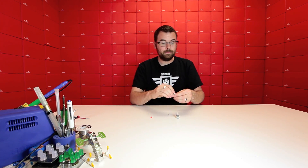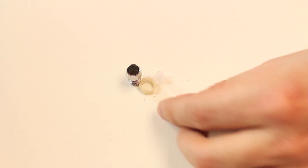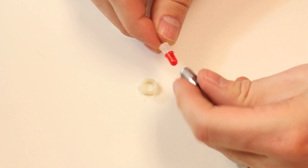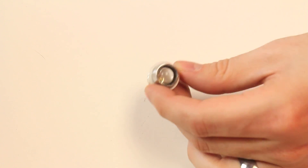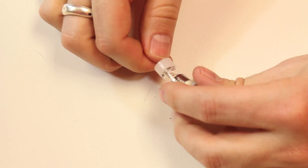If you do want to mount your own LED, we have these two LED holders — in a five millimeter and a ten millimeter size. You've got this chrome plastic barrel, the nut, and then the back receiver cap. What you do is slide the LED into the cup, feed it down, insert it in, and then tighten the nut on the back. Now you have a really clean panel mount LED that works nicely as an indicator light. We have the exact same thing for all of our ten millimeter LEDs, so if you want a nice big shiny LED indicator, check out the ten millimeter. It's quite a bit bigger, has a washer and nut, and the same plug-in back.